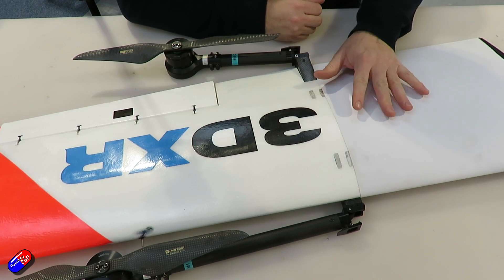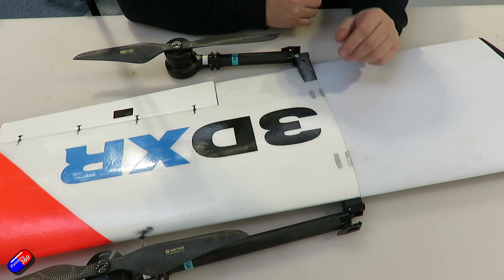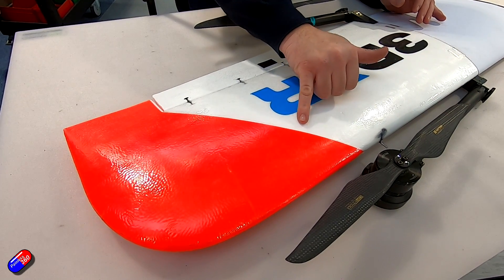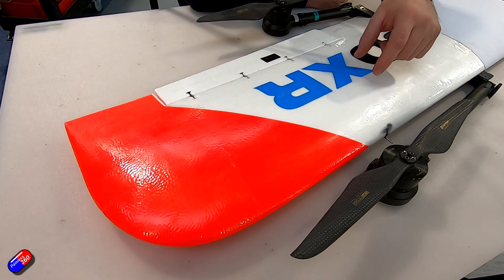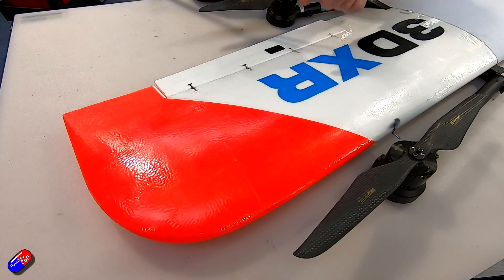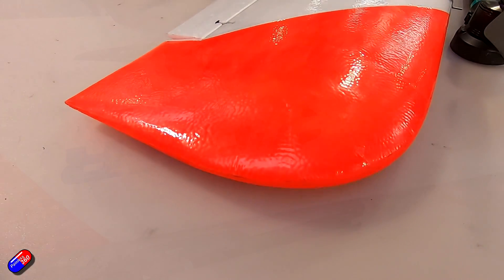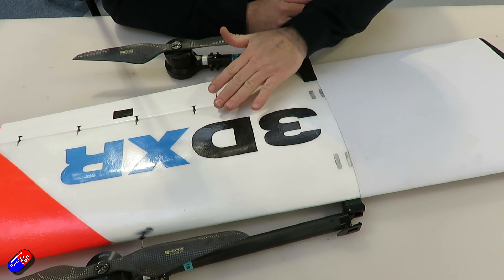Let's have a look at a finished wing. Just like the body we've used the laminate on the wing, and the plastic dip fluorescent spray — a couple of coats of white first then fluorescent. To make a neat line we use a pinstripe — what people used to use on cars. The masking tape edge gets cut away with a scour pad and then the pinstripe really finishes it off. We're able to get quite far to the edge before stopping the lamination. We've got our stickers on, and we now sink them under the laminate because customers were peeling them off.